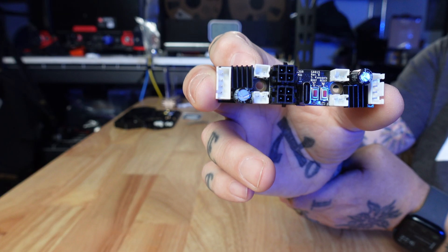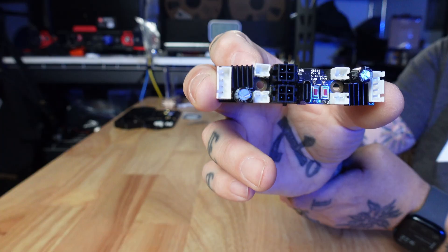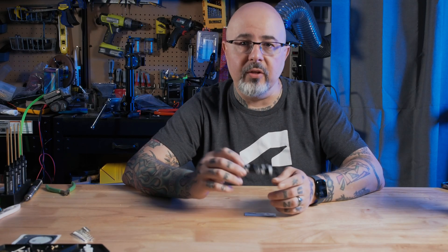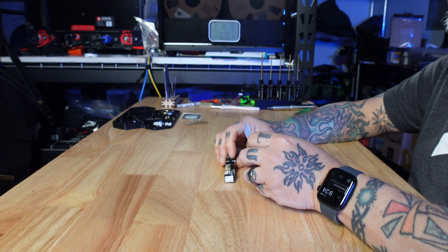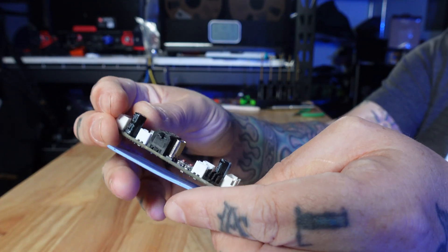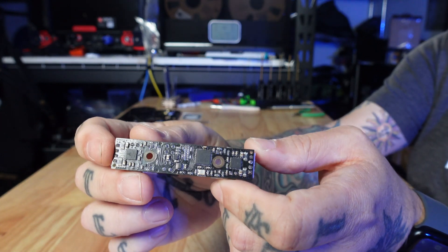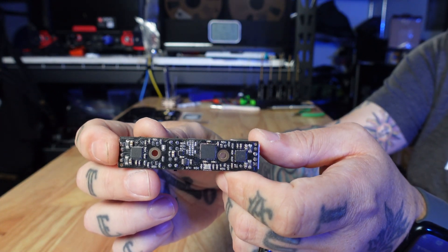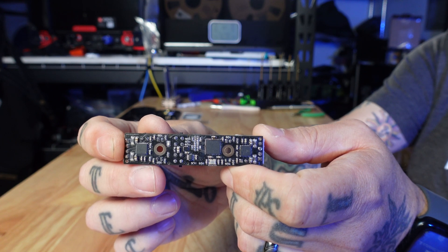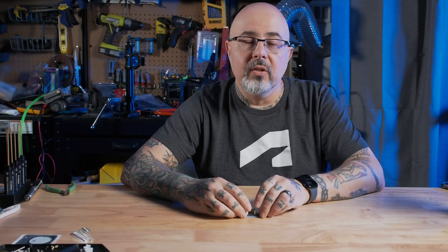According to the documentation, the thermistor on the board itself can read high, so I'm going to use an external thermistor and use one of the ports as the chamber temperature sensor. In the package, you get the GBB-15 itself, along with heatsink tape which you sandwich between the extrusion and the bottom of the board, because the 2209 stepper drivers are underneath and it actually uses the extrusion as an additional heatsink for those stepper drivers.